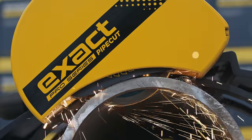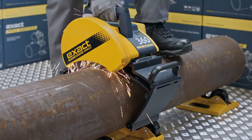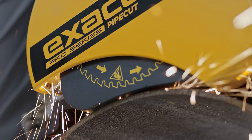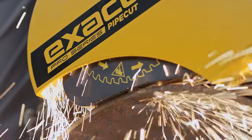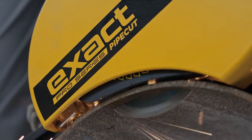If you are experiencing problems during cutting such as abnormal sounds or vibrations, stop cutting and lift the motor unit to the starting position, inspecting the saw and the saw blade. Once the problem has been cleared, proceed with the cutting. Never start the motor while the motor unit is locked down in cutting position or if the saw blade is in contact with the pipe.